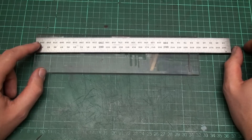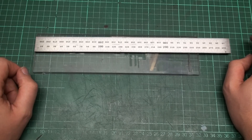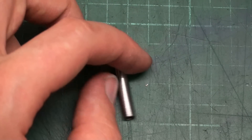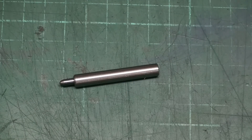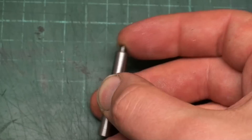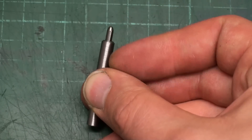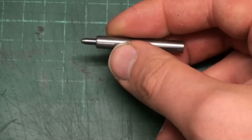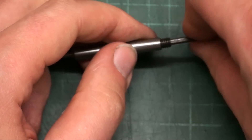The engraving machine, with its mechanical reduction of length, should give me enough resolution to get such fine engravings. We're not going to engrave this graduation with a normal rotating cutter. We're going to use this tool — I made this some time ago and it's a spring-loaded carbide point for drag engraving. It's a pretty simple build.